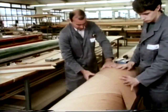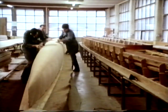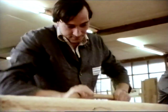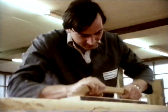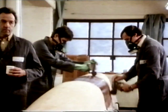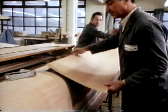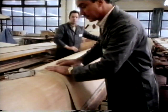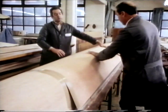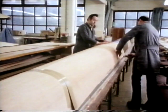A second layer follows diagonally to the first one. The boards are glued together and then polished by hand. The hull is then again covered with waterproof glue. The third layer of cedar is put on along the length of the boat and is also stapled on temporarily. The lamination of all three layers is accomplished in a vacuum system which makes the hull very stiff and sturdy.